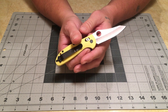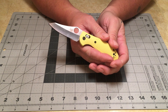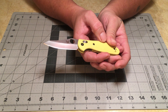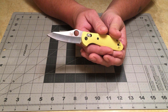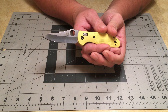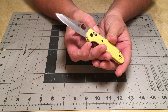The 8k, again, is coarser grit than the rating states, at least in my opinion. When I hear 8k I start thinking mirror polish, but the polish was only starting to peak out more — you could see some luster, and if you took your knife to a strop after that stone I have no doubts it would produce a pretty bright polish. It was also very hard, reminded me of the Shapton Pros. Then by the time we get to the 10k — very hard, started giving you a mirror polish. It had very little steel removal, which means that stone is really fine. I think the longer you spend on it, probably the better polish you can get out of it.